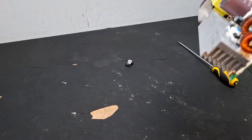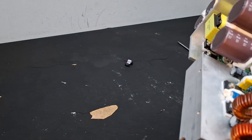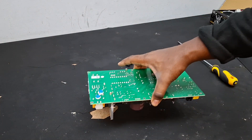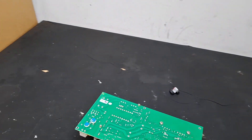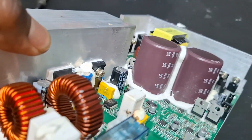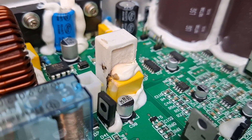Another thing I've realized is that when you switch on this unit, this relay after maybe five to six seconds will switch on, which is for your output. Which means if there's any fault on the output side of this board, the relay won't click — and that was my opinion, it's not clicking. Let's investigate further on this board. I had a close look and there's something I picked up here — that capacitor and that resistor looked like they showed signs of being burned.